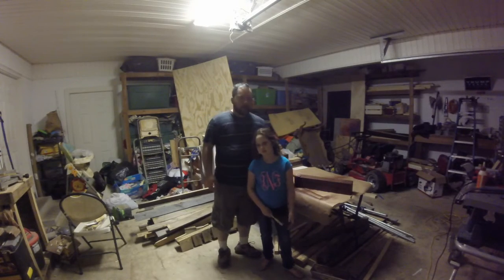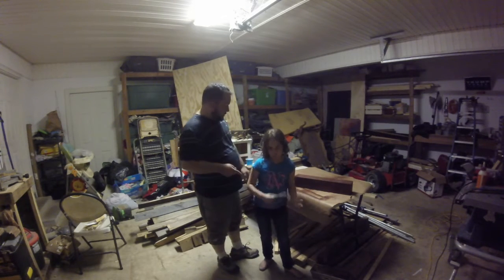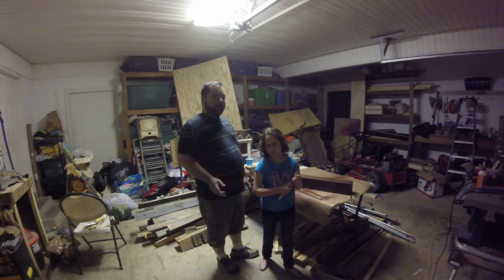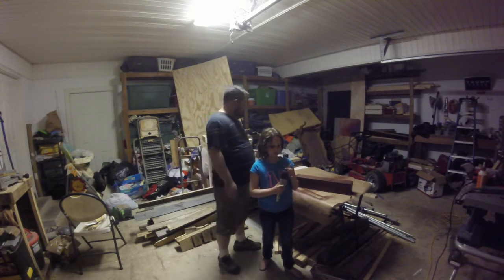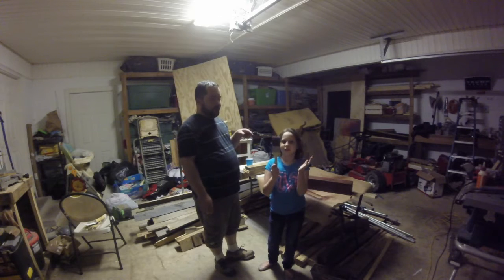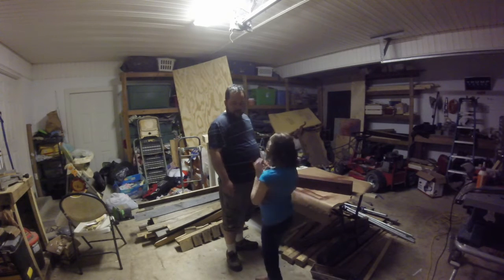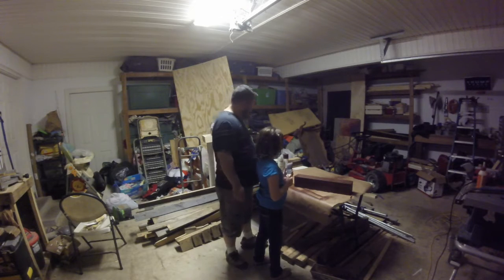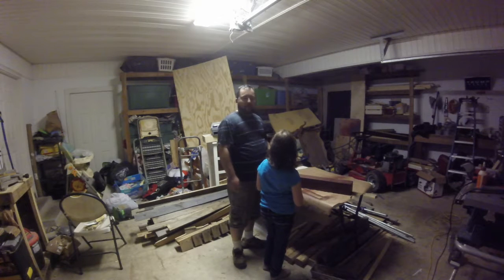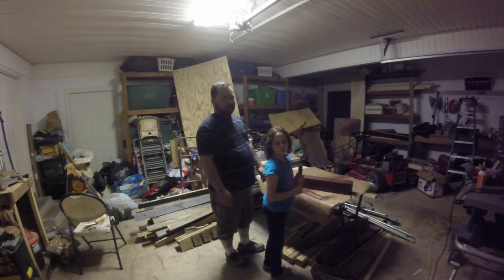Okay, well now that the brown bottom coat has settled, we're going to go ahead and put on the white coat. This coat you want to make sure you lay down really thick and with a good quality paintbrush. Don't try to leave in your distressing now. You're going to apply that with sandpaper later, and we'll go over that when we get there. Anna is going to help me with this part. She loves painting. She's really good. And we got a brand new brush for this. Really soft. Just a standard 2-inch flat brush. Nothing special about the paint we're using, but it is paint and primer in one. It goes on a bit thicker, and that's what we want here, a good, solid, thick coat, because we only typically do one coat on the white, unless it just looks really bad, then we have to go back to the second coat.